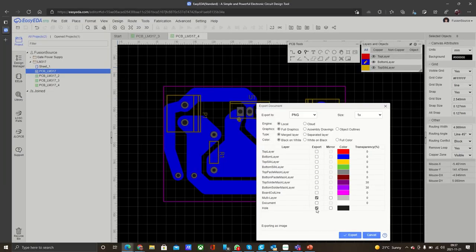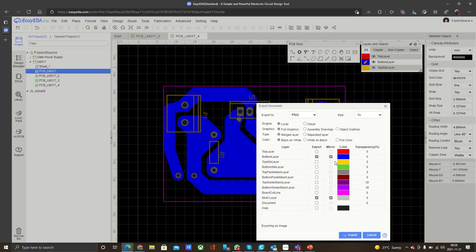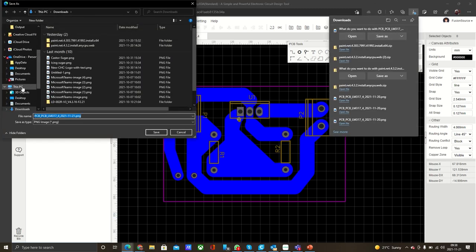For now we won't go that far. I'm going to go Multi-layer, which covers my vias and holes, and then I'm going to go Bottom Layer. I'm going to mirror both of these because I want to print it upside down — I'm going to put it onto the PC board, stick it on, and etch it away. We're currently looking from the top where the components are, so I export this and save it to a folder with a nice name.